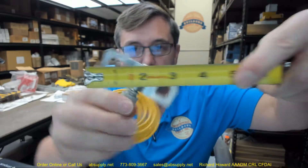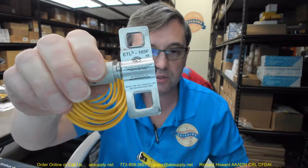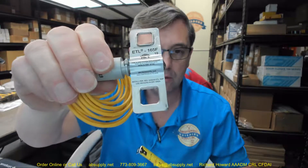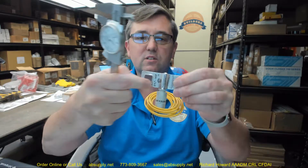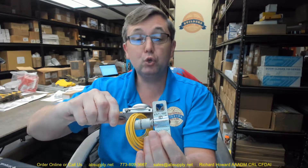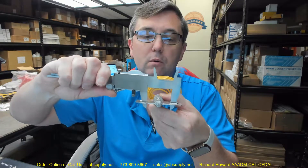Overall length is about 3 and 1/8 inches. Overall height is 1 inch. Fire alarm system replacement part in accordance with NFPA 72, 1990 version, SR Products. The overall width is 0.496 by 0.492 inches. The dimension between the link halves is 1.58 inches.